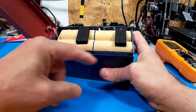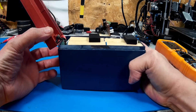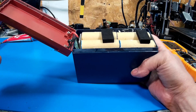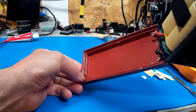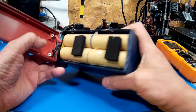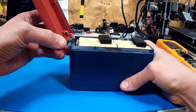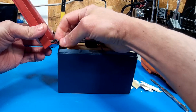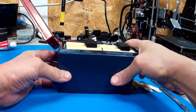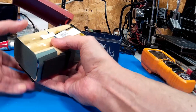You have to dig that rubber out. Be careful on this side because there's a white wire that comes around the back — you don't want to damage that. As soon as I opened it up, I didn't even have to dig into it to find damage. There's damage to the case here — someone was chiseling away at it, which I don't get because it's not chiseled on the other side. And right there, there's some damage to the black wire. It still works, but there's bare wire hanging out and a couple of threads are actually damaged — so that would be a failure point right there.